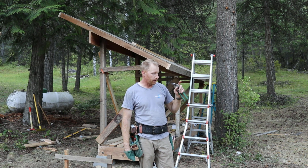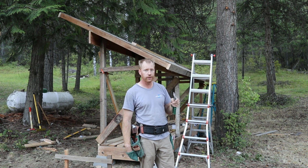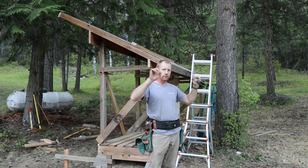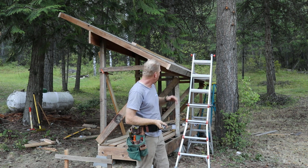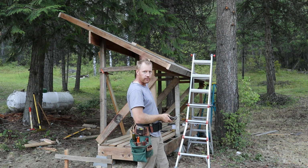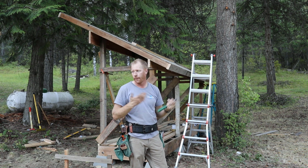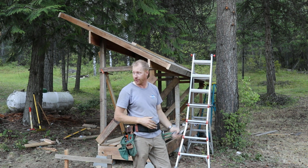We're going to put on a 1.5 inch drip edge, just a basic drip edge all the way around. We'll do the bottom. I'll do very basic returns because I have a large number of sheet metal tools. In other words, this one pair of snips. I'll do small returns up the sides. We'll do the sides next and then the top. That way everything's lapped properly for water. Not a big deal because this isn't going to be a watertight scenario.